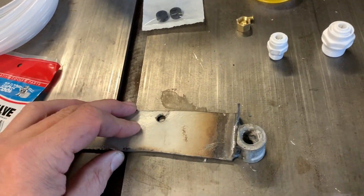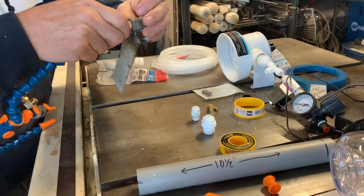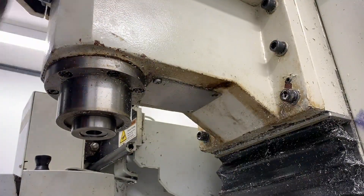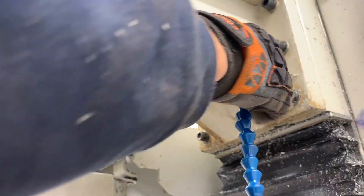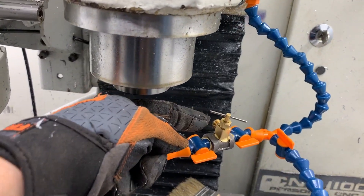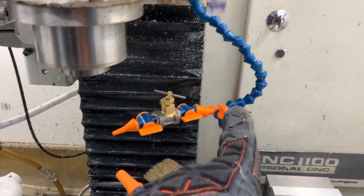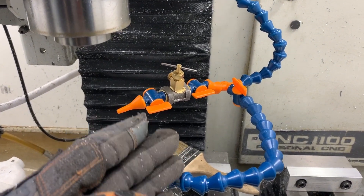I went ahead and welded that coupler to it. I tried to use some zip ties and that didn't work out for me. So I'm going to get all the plumbing put back into it and then we'll get this put on the machine. We're going to drill a couple of holes on the right side of the mill. I'm going to leave enough line up and over — the air is going to come in here and the WD-40 is just going to parallel that and I'll zip tie it to the lock line. The WD-40 will come in here so I can adjust this needle valve for it. The air will split off here so I can run a little bit higher pressure here and then turn it down here, and if I need to control the whole spray there.